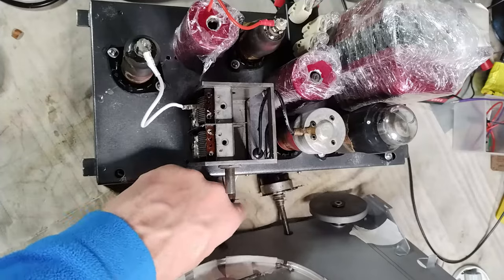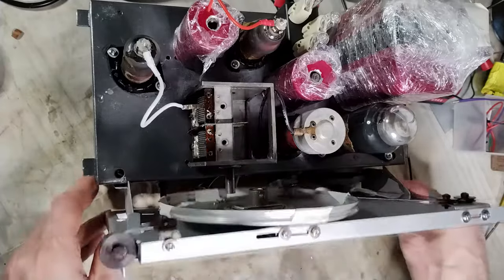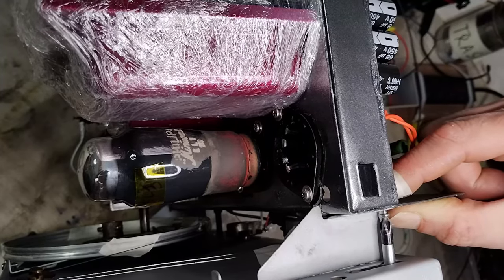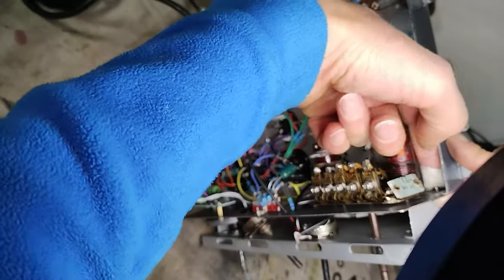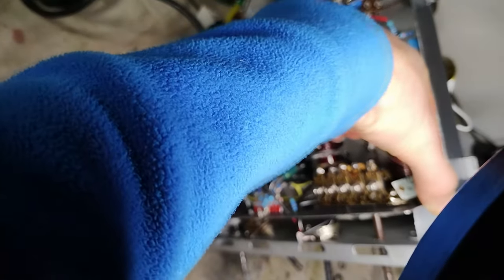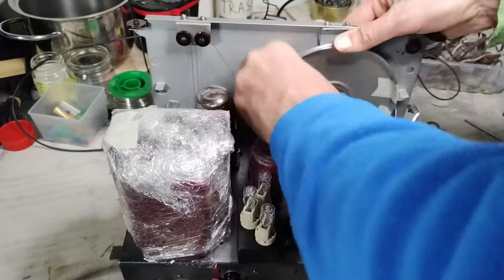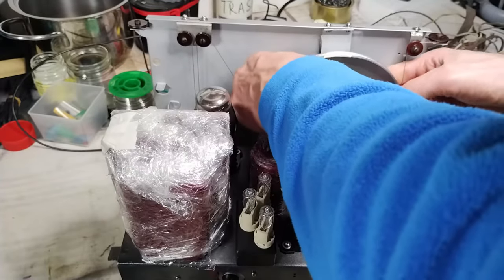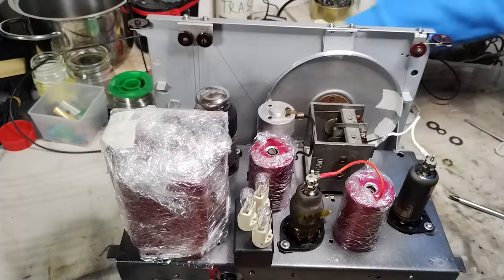Mounting the dial panel on the chassis is not so straightforward. These clips show an attempt that later had to be repeated because the dial cord was too tense. In fact, the drum must be pushed down to be inserted on the variable capacitor shaft, increasing the tension on the cord, which must be calculated in advance.